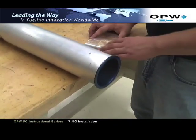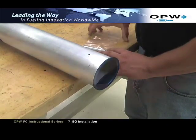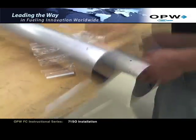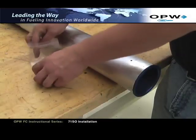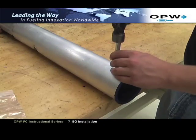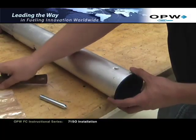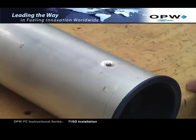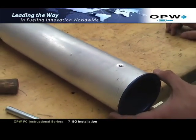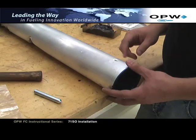First, place the end of the upper tube over the edge of a solid surface to avoid damaging the inlet tube lip extending out the end of the upper tube. Remove the dimpling punch from the plastic bag. Align the tip of the punch with the drill hole and dimple the upper tube by striking the punch with a hammer until the upper tube is formed into a countersunk hole. Make sure that the dimple is deep enough so the screw head, once tightened, fully seats flush with the surface of the drop tube. After punching, remove any metal chips.